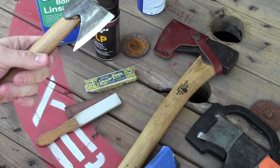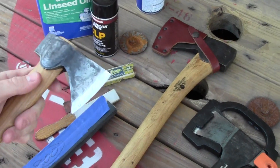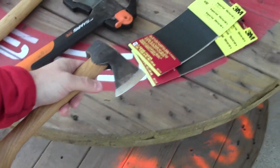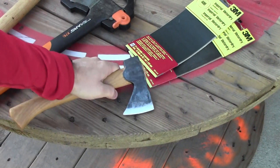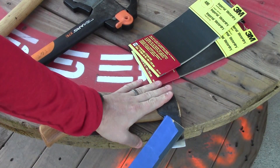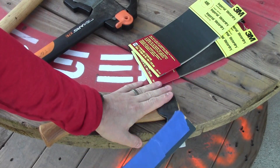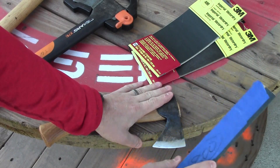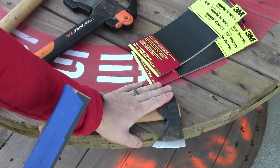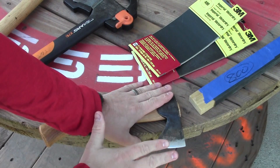Let me give a little clarification on the way I'm using the sandpaper. I come to the edge of a desk or table and hold the axe down like so, then I move the piece of sandpaper along it while maintaining the same exact angle. This way, instead of having the sharp object moving around, I'm moving the sharpening tool — that minimizes danger to me and I think it maximizes my time and allows me to be more precise with my sharpening.